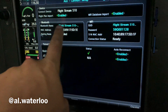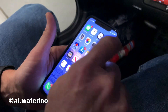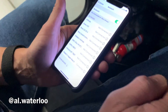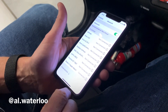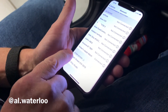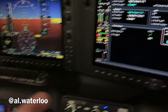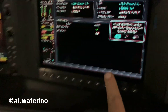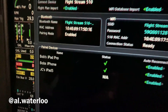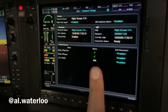The first thing we're going to do with Bluetooth is go into our phone settings and connect. Go to Settings, then go to Bluetooth. At the very bottom it usually takes up to 30 seconds for it to show up. There's our Flightstream device — we're going to pair it there, there's our number, and we've got a verifying pairing here where we can go ahead and hit Enter to accept that, hit it on the phone. Now we can see that we're successfully connected to the MFD via Bluetooth. That's step one.